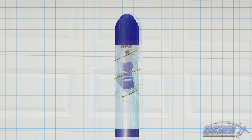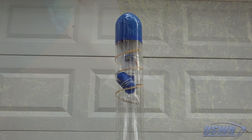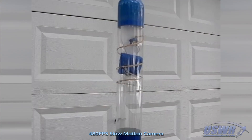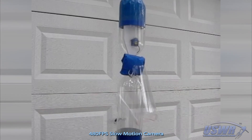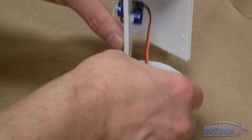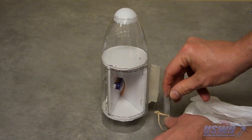The radial deploy system is now complete. The way in which the radial deploy system works deserves some explanation. The method is so simple — it relies on only one moving part: the rubber band. When the deploy release is triggered, the rubber band is released and it will begin to unwrap itself as it unwinds from the parachute cover. The tightly wrapped rubber band reaches a very high speed as it swings around the rocket until it becomes fully unwrapped. At this moment, the rubber band is a swinging mass traveling at very high speed, and centripetal force simply pulls the parachute cover off the rocket, taking the parachute with it and deploying it. The design of this system eliminates unnecessary moving parts and places where the parachute can tangle or snag, which increases the reliability dramatically.